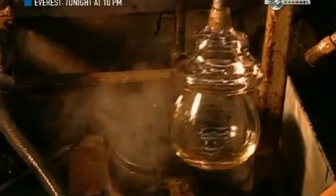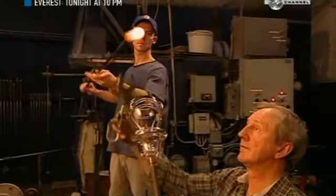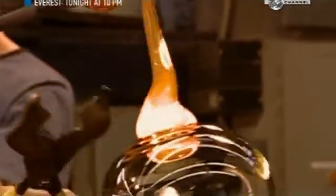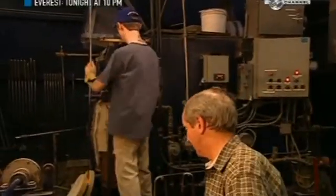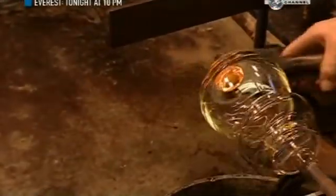The blower releases the ball, now called the bowl, using a foot pedal. After cooling the bowl for 1 minute, another craftsman called a stemmer adds another gather to create the stem of the wine glass. He clips the gather with heat-resistant scissors. He uses a wooden divider to shape the stem area and a metal divider to stretch the gather into the shape of the stem. The stemmer must be highly skilled.